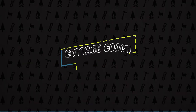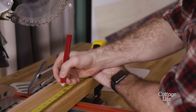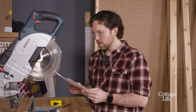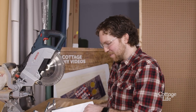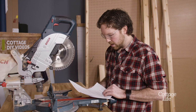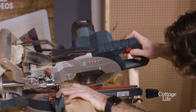The project has begun. Trim one inch at 45 degrees from the corners of two of the outer tabletop boards. Starting to look like a picnic table. I miter the ends of my cleats to match the tabletop boards — Wayne is a smart man. That's nice.